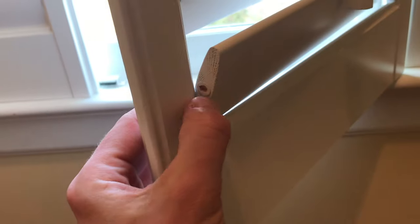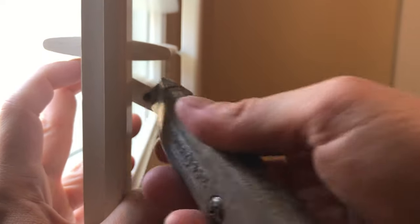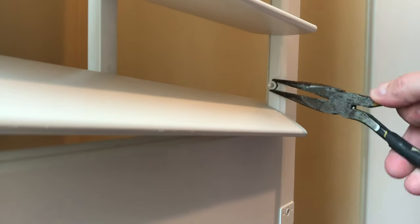To install these, you just have to get the old slat kind of moved out of the way. If it's just broken on one side, you just tilt it down a little bit, and you'll notice that more than likely the little wooden bits of dowel are still in the hole in the slat and the hole in the style. You've got to get these cleaned out. Sometimes you can pick them out with a utility knife. That wasn't the situation here — they were pressed in too deeply, and as you can see, when I test fit my spring-loaded pin, it wouldn't go all the way back in. I need it to sit flush.